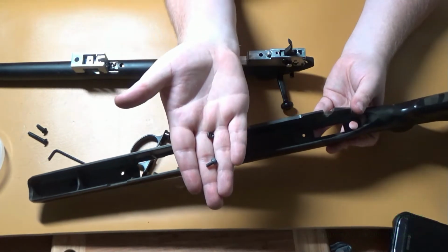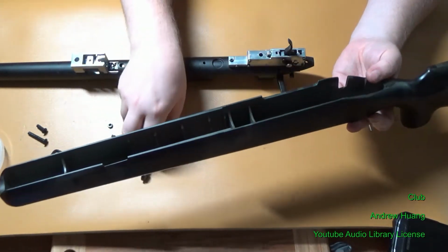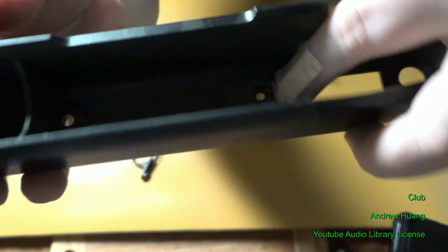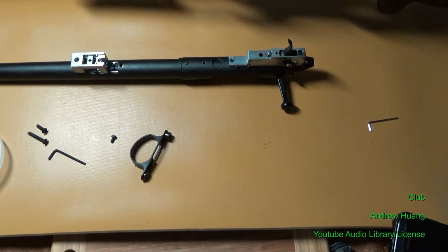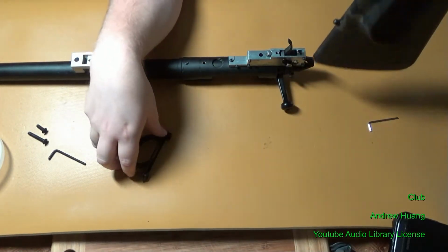as we made note earlier, this screw and this nut came out. We don't have to take these parts out, but for the full teardown, I did. This nut goes in the little hex hole there, so it just sits right in. It is not glued in place from the factory. You can glue it in if you want. It's not going to affect anything.